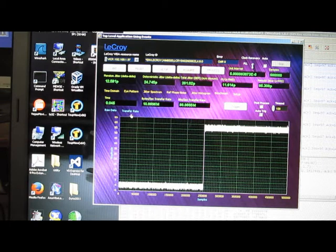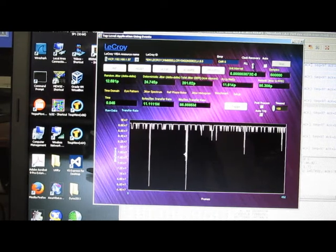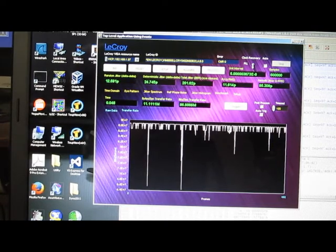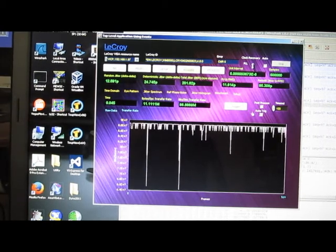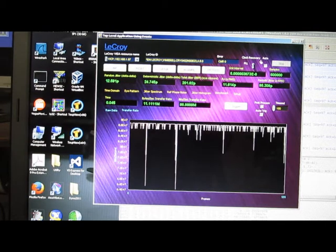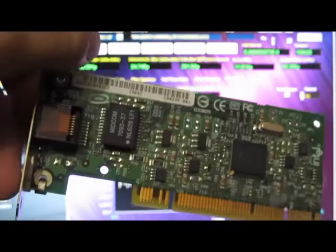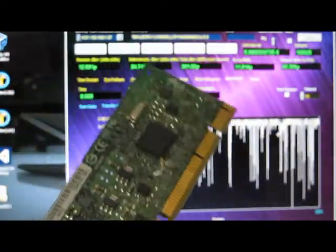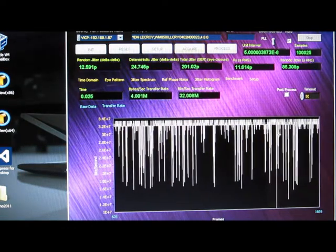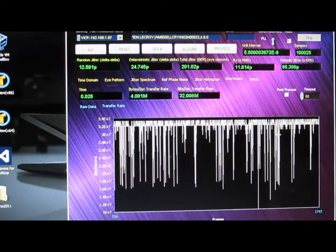So the key here is: can we get it up over a hundred megabits by changing out to a one gigabit board? Here we can see it's fairly stable. I would expect there to be some hiccups if I'm doing things with Windows — that would be pretty common. So let's go ahead and select the other board. To make these tests, I plan to install this Intel Pro 1000 GT — just a standard PCI bus. Let's give it a shot and see if it speeds it up.